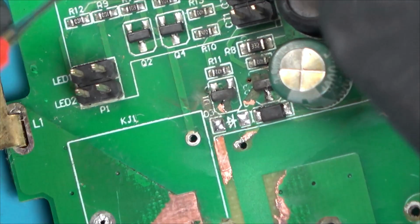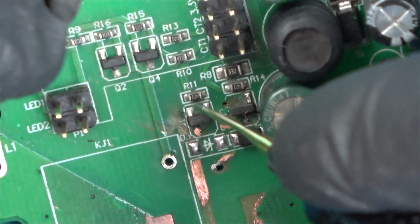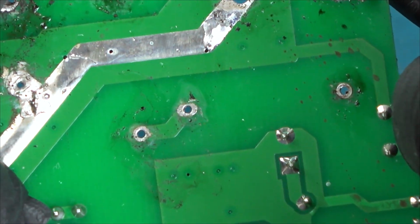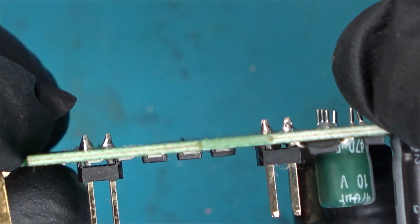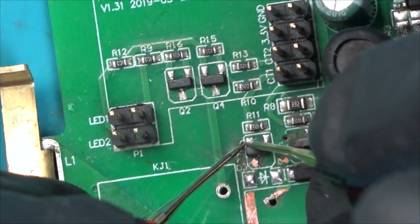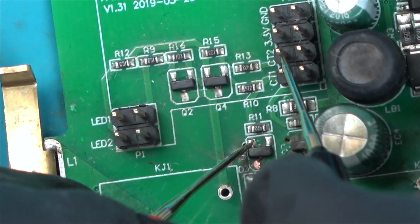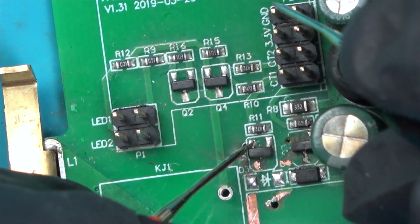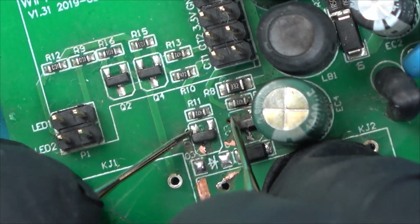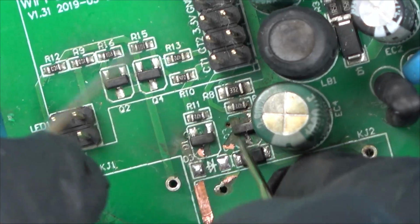And so this one goes off to a via. So where does this go to? And we might, in fact, it goes off to two vias. Here and here. What's on the opposite side there? That's not helpful. So it is a multi-layer board. So it means it's travelling down the middle of the board somewhere. Ground? Oh, it's a ground. So it looks like that's going to be ground as well. So that's going to the via. So the via is still intact.